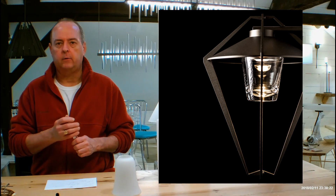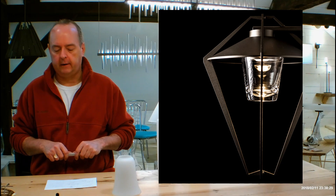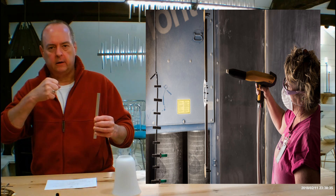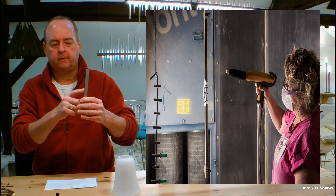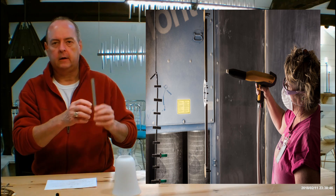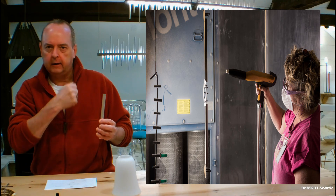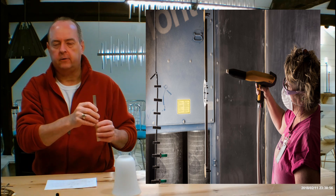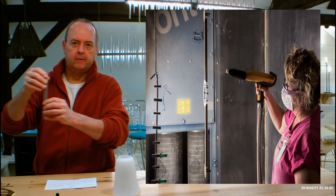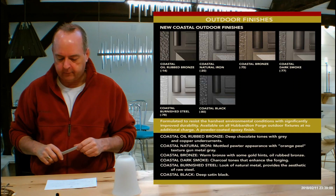On top of that, they have developed outdoor baked epoxy powder coats that go over this and make them pretty much indestructible. You'll notice in the picture next to me there's a picture of a woman shooting a powdered finish at the fixture. They wire the fixture up and run a small amount of electricity through it to make it positive, which makes it attract everything around it. When she's spraying little bits of powdered finish, it goes over the entire fixture — into every nook, every cranny, top, bottom, sides, the whole thing. They then put the fixture into an oven, which melts it down and makes it into a hard epoxy shell, making it incredibly strong.